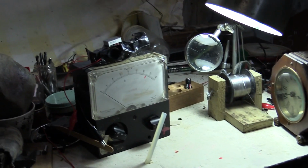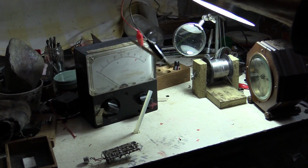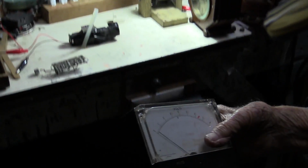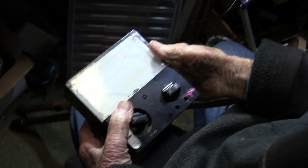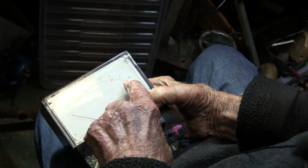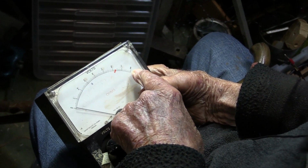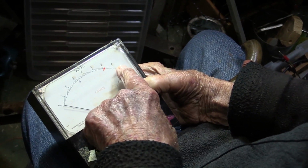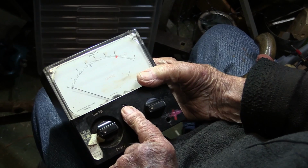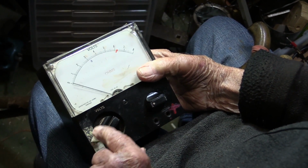Now, you've got an old ohm meter there. That was a post office linesman's meter. Somebody gave it to me, and they changed it, and I recalibrated them, and I get 8 volts full scale, or twice 16, depending on if I'm checking the car battery. I use a 16, and if I want continuity, I put it down here, and that brings in the ohm scale.